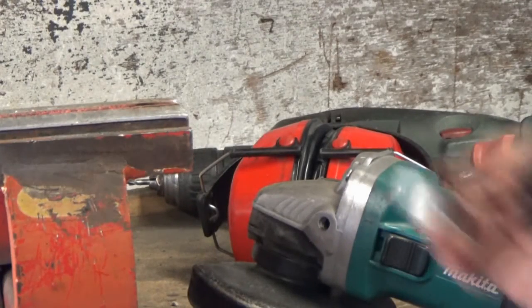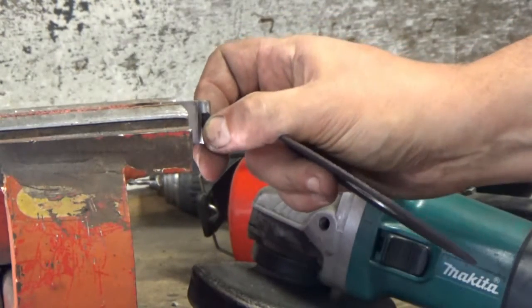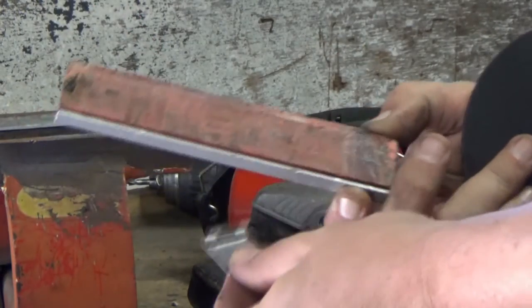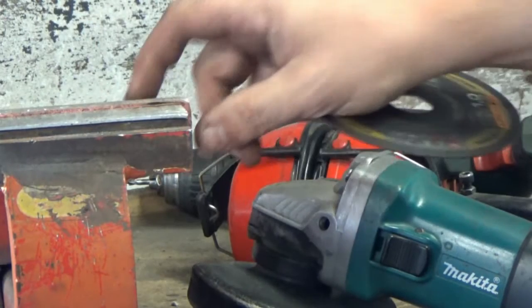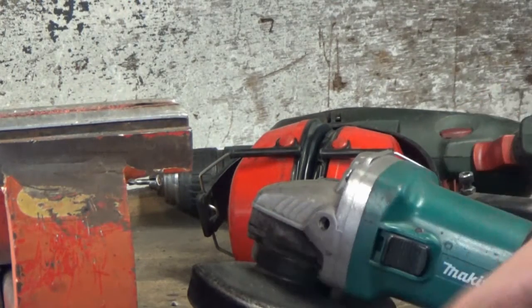So what I've got set up here is a small vise. I'm going to drop these in just in there. I've got some vise grippers here. They're not important, they just stop this rubberized surface marring the actual hinge parts with the grips in the vise. Slips of wood would do, or if you haven't got them, it doesn't matter that much. Just don't get carried away and grip too hard.